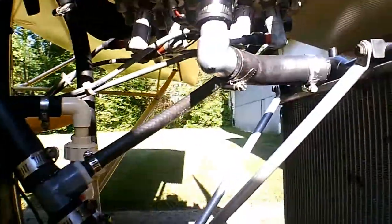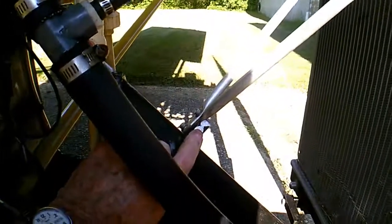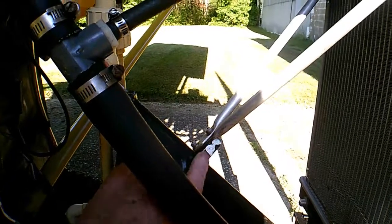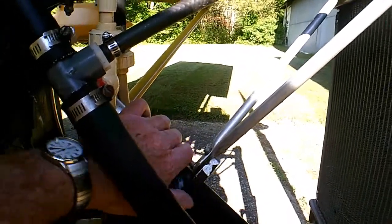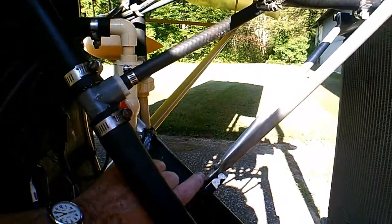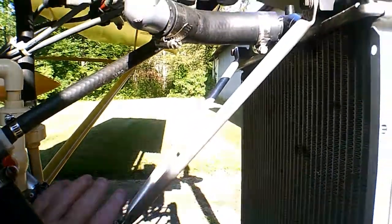Somebody was asking me about how I mounted the radiator. I mounted it onto this tube right here, which kind of braces the tail boom. I made clamps — basically drilling a one-inch hole through two blocks of aluminum that are screwed together. It's what I call a pinch bolt clamp. It just pinches on this tube, and then I have something I can bolt to. I put screws in here, and these braces here brace the top of the radiator.